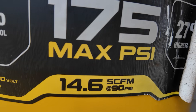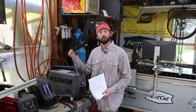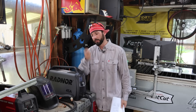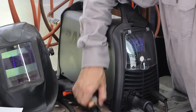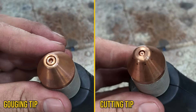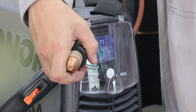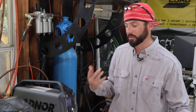We should be fine with the compressor outside. You don't necessarily need a huge compressor — think about how much cutting you'll be doing. If you're running a CNC table with long cuts, you want a compressor that outworks you. But if you're just running one of these machines in the field, you could probably run it off a little pancake compressor if you're only cutting quarter-inch material a little bit at a time — let the compressor catch up and keep going. This machine came with some gouging tips I've never seen before. The nozzle has a wider hole and it's a little bit recessed, so more of that arc can fan out for gouging. We'll try it at 30 amps, then switch to cut mode with regular consumables and see if we can match it. The worst thing is we're still going to have to hit it with the grinder afterwards, because we don't want to weld over anything that's plasma gouged or cut.